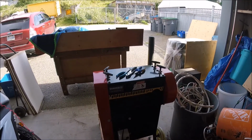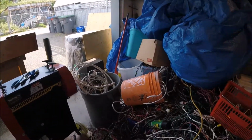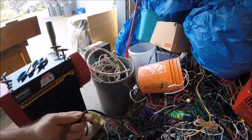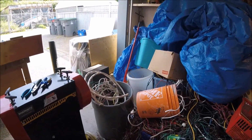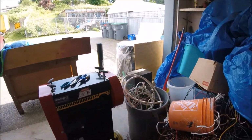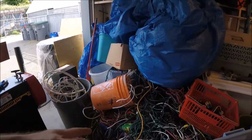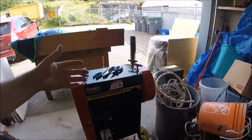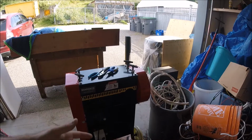But like I say, it still works pretty good on some wires. But it is pretty finicky, and stuff like this, you know, it's pretty tough. And I'm thinking maybe because the weather is really hot, it's 30 degrees right now. It's probably more like 100 degrees Fahrenheit in this garage here, super hot in here. I think what's happening is the wire's getting soft on the plastic, and the motor's heating up, so you're getting maybe 120, 130 Fahrenheit.